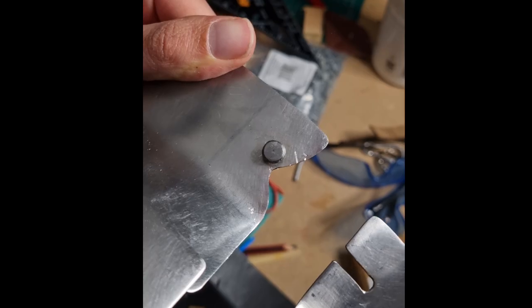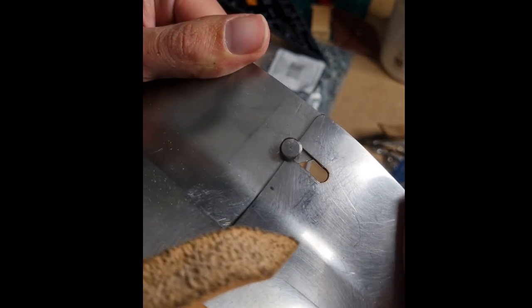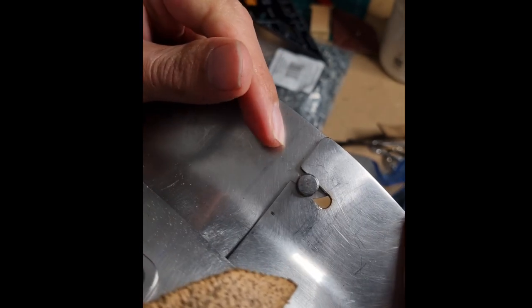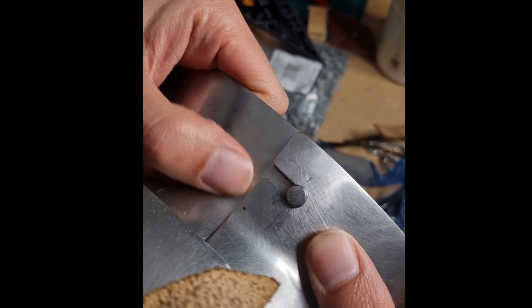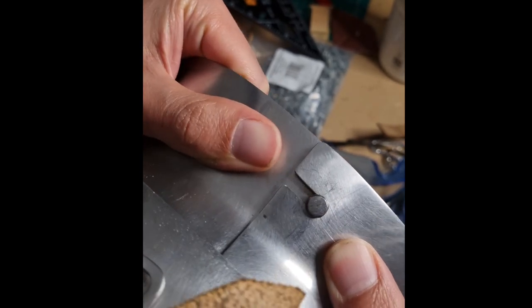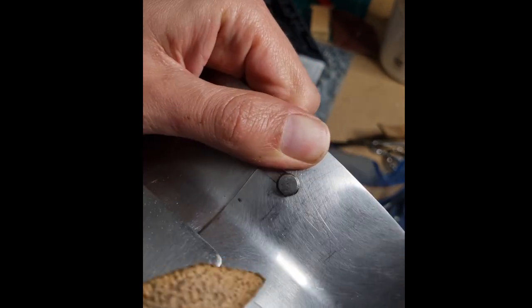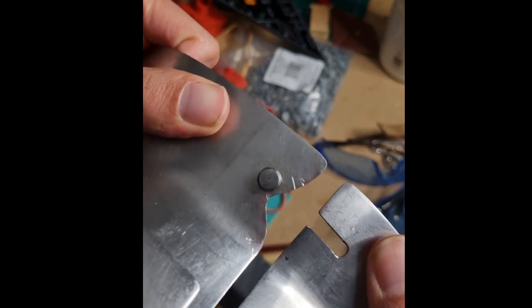So it's taken a long time, but I've done it. I've added the stop rivet into the fold so now it can't get smaller than a certain size. Here's the rivet, and here is the slot — so it can't get any smaller than that. John and I drew lines to make sure that was the right size; if it got to that size, it couldn't fall out of the bottom. This will stop it from getting any smaller, and then the size of the breastplate will stop it from getting any bigger.